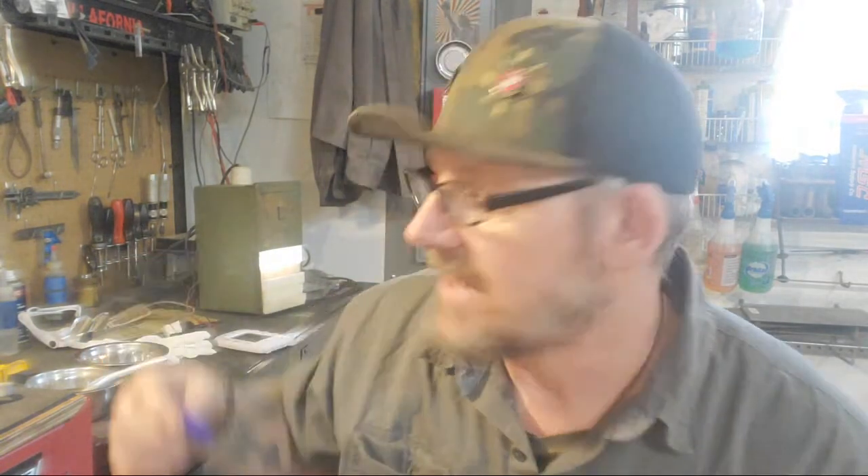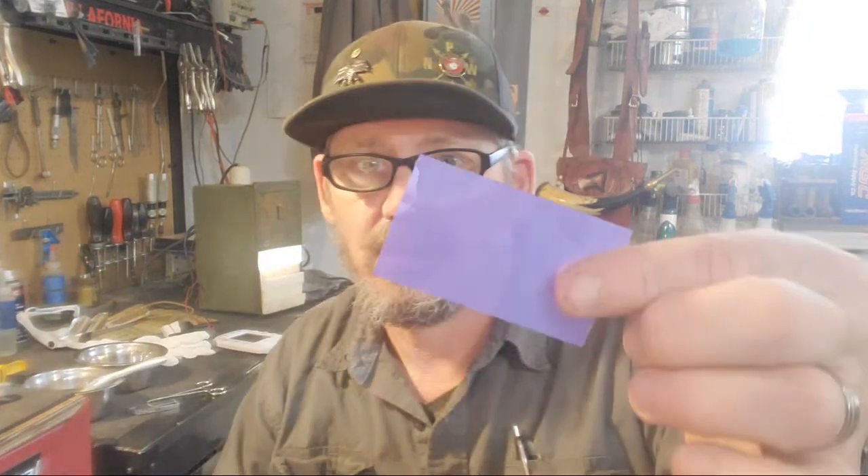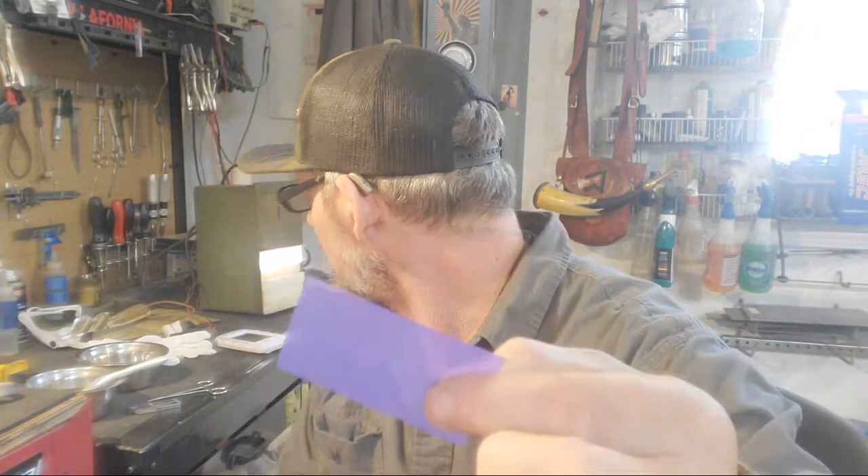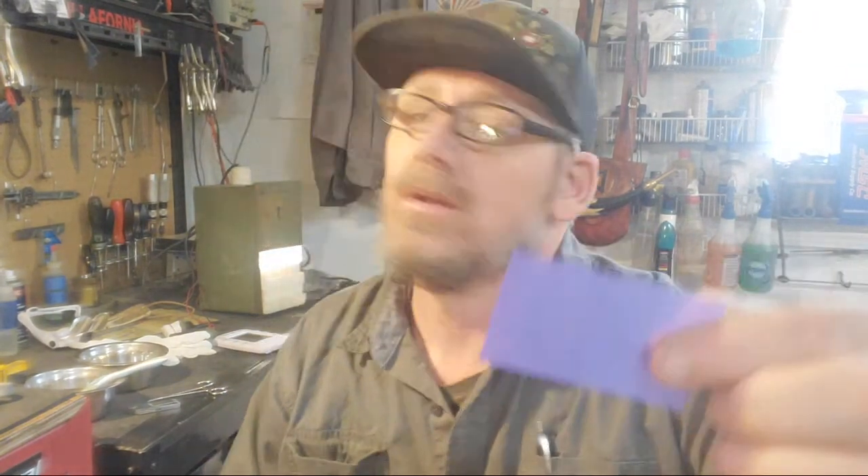Here's an example of an overexposed one — it's got a norseman on it, and I left it for too long. Some of that light crept in and cured it underneath the masking. So those are three examples of things that can go wrong. Also, this older piece has already changed color — a new piece is a fairly light, almost transparent blue, and once they start darkening up they're basically being exposed and you can't do much with them.